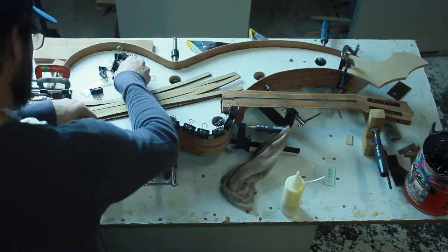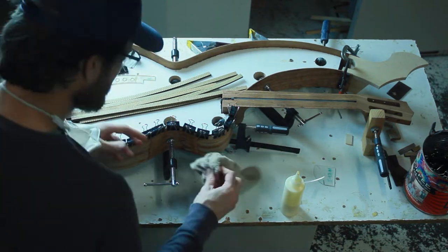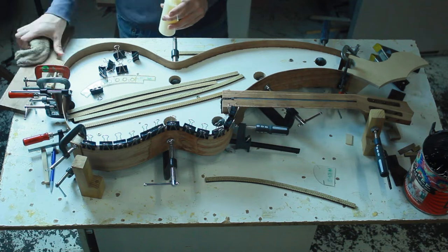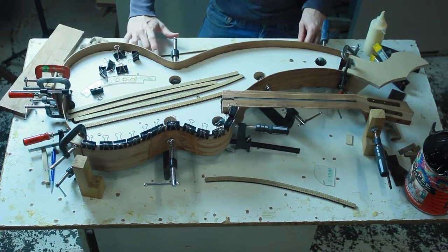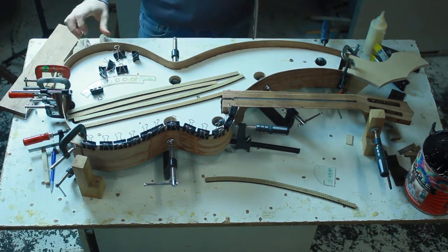It's basically an entire outline of the guitar. You don't want to do this without it being in that melamine mold inside of there — that's an interior mold we're using made out of melamine. So it sort of skipped showing the clamp-up with those blocks, but you can see they're all clamped up.